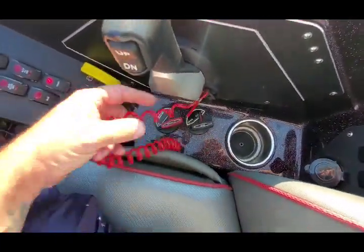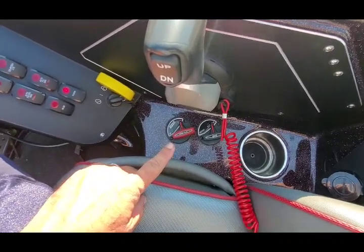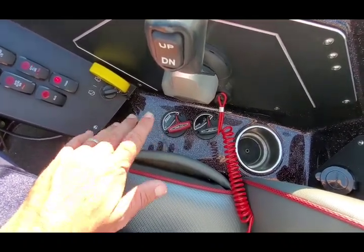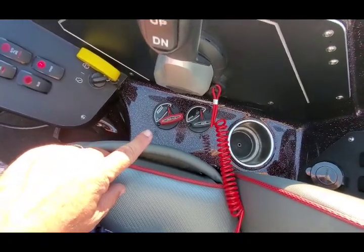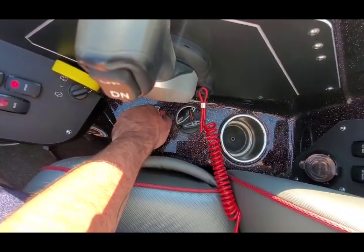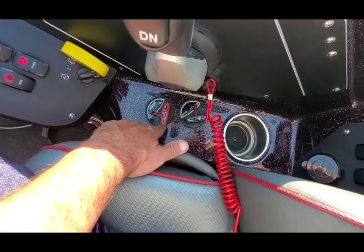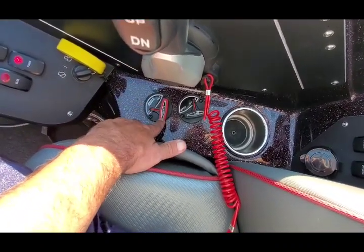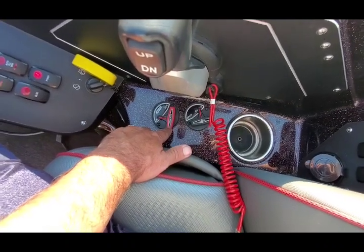Over here on the side, obviously by the kill switch, you have the open and close for the live well, and you also have a remote drain plug. When I bought the boat, I asked about the remote drain plug because it had me a little worried — I'm kind of old school and would rather just put a plug in and turn it. What he told me is when you close this drain plug, you turn it, feel it, and then turn it just a slight bit more and you'll feel it suck in. The problem people have is they turn it too hard, so it breaks or wears the seals out. Just be careful and don't be overly aggressive with that plug.